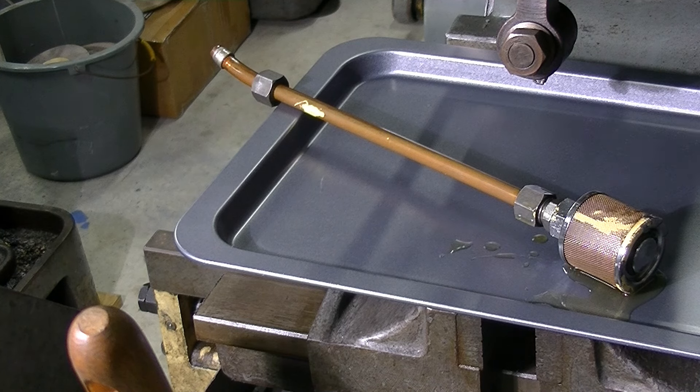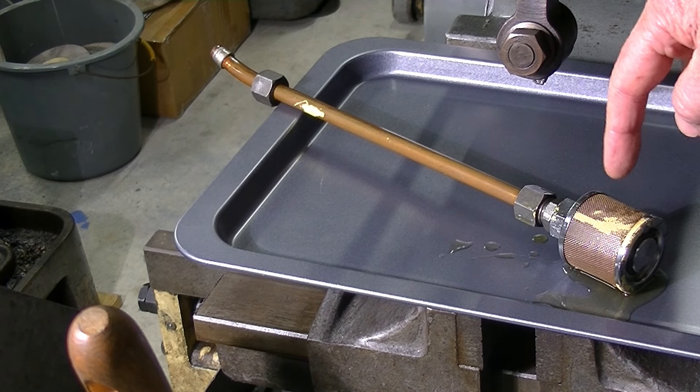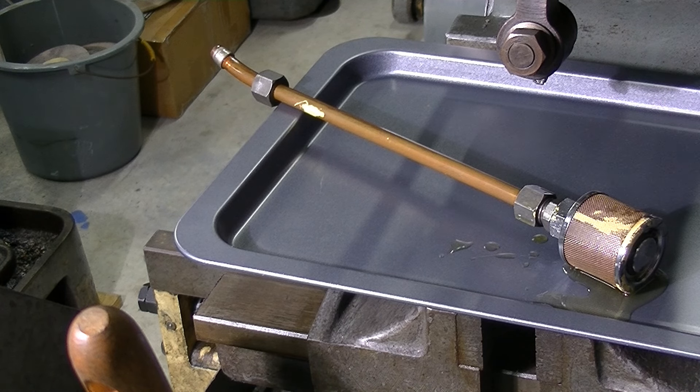Here's at first glance what I thought would be the problem. You can see what I'm talking about with the mismatch of material - that's an aluminium ferrule on a piece of copper pipe with a steel nut, a steel hydraulic coupling into a stainless steel fitting, bronze gauze and pressed stainless steel end caps. I'm thinking that must have just been scrap out of the factory to put something together like that. But I'll be honest - there was no growth around the strainer, so that rules that out. As I lifted it up I could hear all the oil glugging out of the inlet line. This thing was primed and ready to go and just not making any oil - doesn't make sense. The nut that held the pickup line in was firm - tight enough. So I'm starting to shake my head. First thing I'm going to do is just put it back in and give it another try - could have been a bad day for an oil pump.